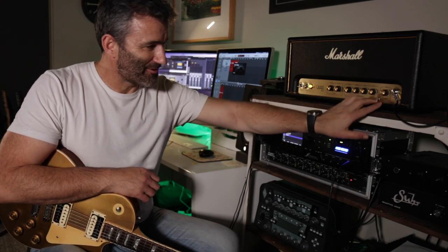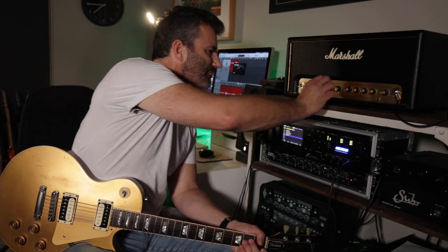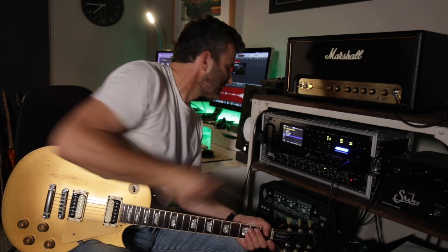If you've been following the channel you've heard lots of demos of this tone, so I won't go on. Let's move to the second clipping mode — this is the asymmetric clipping, with a 5-volt Zener one way and a 24-volt Zener the other. I'll bring the master up even a little bit more because it will drop the overall volume.